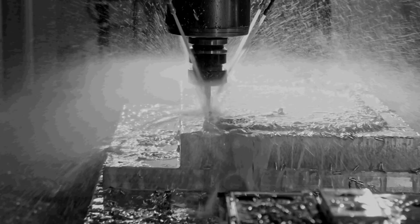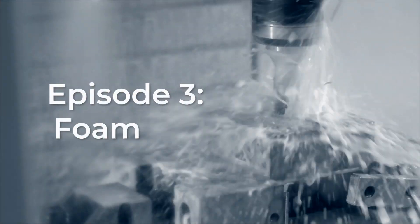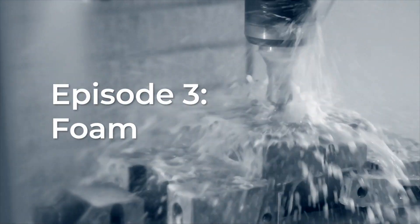We're looking at coolant foaming and how we can fix those issues — a lot of times from high-pressure situations. High-pressure systems are most commonly thought of as causing the foam, but there are a few other things to bring up first. Not every coolant is designed to work with a high-pressure system — it's not that the coolant is bad, it just wasn't designed for it, especially older coolants.